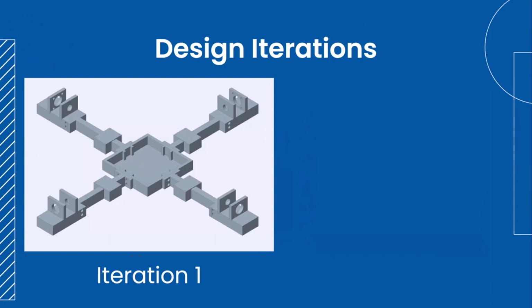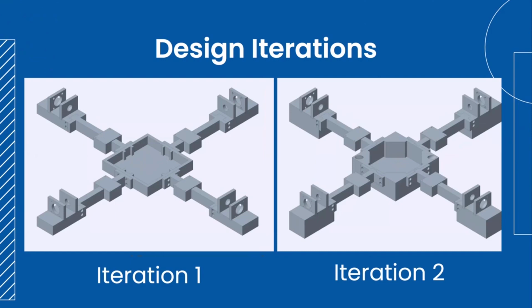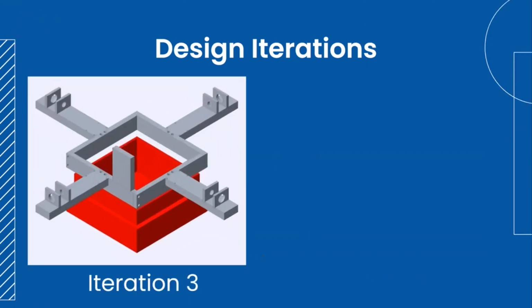device. One of the major components of our device is a water bath to maintain physiological conditions of the tissue samples during testing. To that end, we created a bath out of high-strength acrylic material and secured and sealed it together using a fast-set acrylic cement.